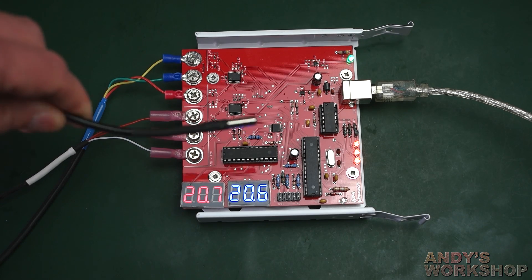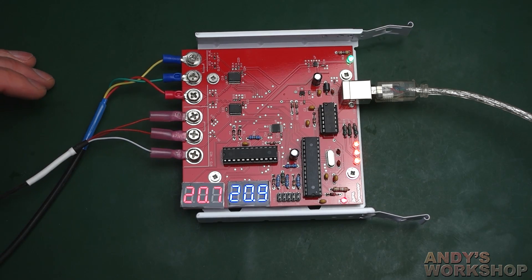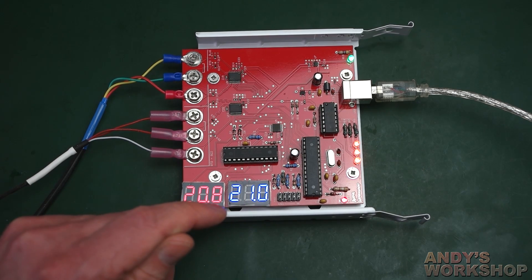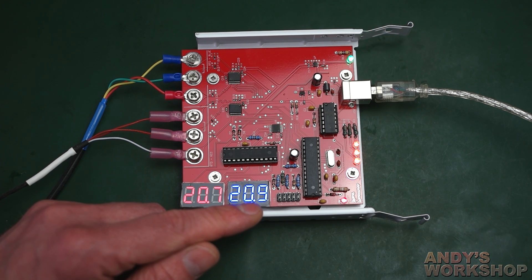It's one of these very common ones — you've probably seen them — advertised as PT100, although without breaking it open you wouldn't know whether it really is platinum inside or something else. The fact that it arrived seven degrees off the correct room temperature is worrying, but that was easily corrected. I've applied a constant calibration offset to make it match the Thermosense probe. I don't intend to use the eBay one for anything serious — it's just a test that two simultaneous probes are working fine.